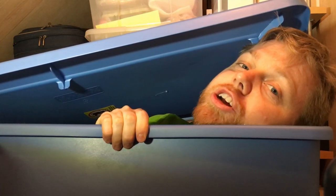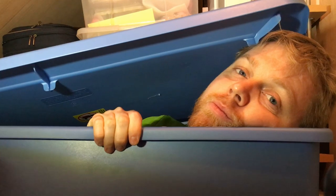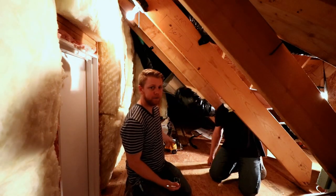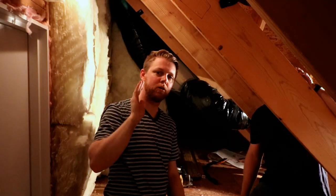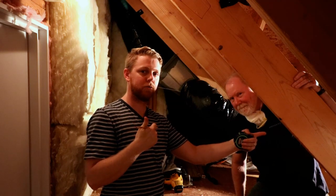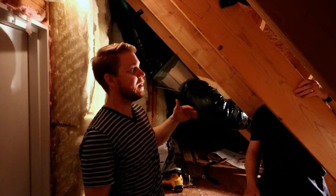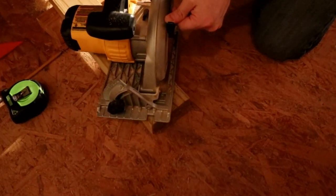As far as the difficulty level on this project, if you don't know how to use a drill, you might want to avoid it. Or maybe it's time for you to learn how to use a drill. We figured out what size door opening we're going to put here just to access the other side of the attic. We're going to come off the wall 12 inches and then make our door rough opening 20 inches. We're going to stud the wall up on the backside of this 2x12, so that when our Luan comes across, it still has the surface of that 2x12 to attach to.